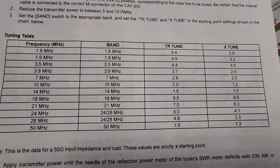We're being very sluggish in adjusting that knob to get it really tuned in to about 10 watts. The SWR on the far right-hand side stayed relatively low because we had tuned the antenna to a low SWR already. Same with the X tune knob — being very, very slow. We're hitting 10 watts, hitting 10 watts — and we actually got a really good setting, slightly different from what was in the table, around 1.75 on TR and just under 1 on X tune. SWR stayed within that green band, and we ended up just about exactly on 1.